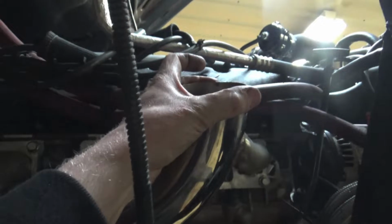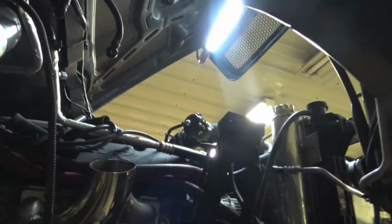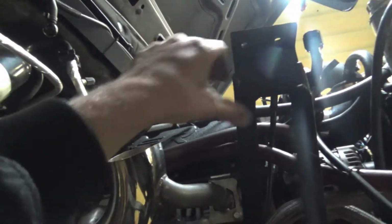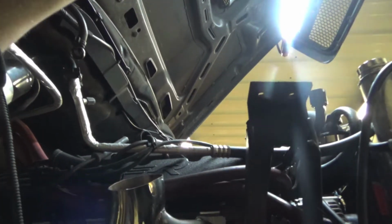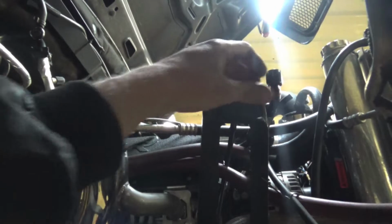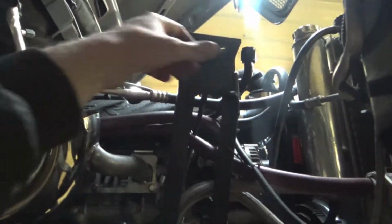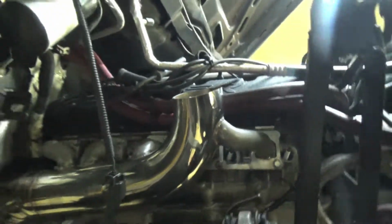We're gonna put a V-band right here, and then I'm in the debate of keeping my turbo here or not. I don't know yet. We're gonna find out, because otherwise it's gonna have to 90. We might actually, because then we can keep the wastegate in the perfect position. We should keep it 90, 90, 90. Like 90 over here and 90 up. I think we should, because then we can keep the wastegate right where the fender dump is, and we don't have to get a new fender. Oh yes. But I'm excited.